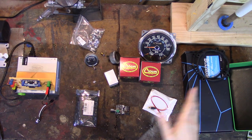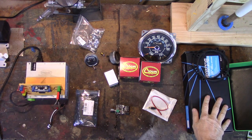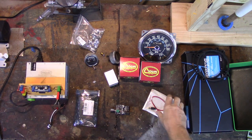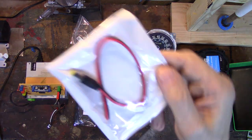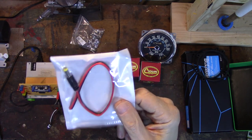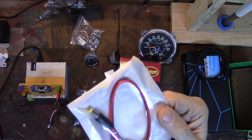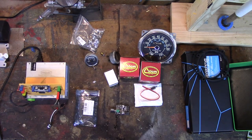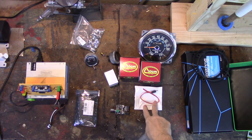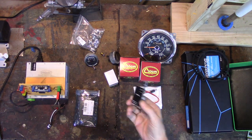Right now I'm going to clear some space out. I've got my little poor man's power supply, I've got the speakers, I'm going to get some wiring. One thing I want to do is test this to make sure it's wired correctly, because I've been burnt by stuff from China before where China thinks positive is black and negative is red. So before I plug it into power and blow it up, I'm going to get my meter out and test that.